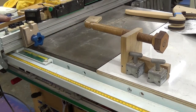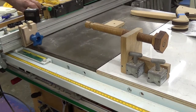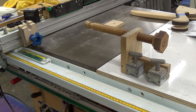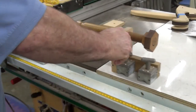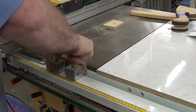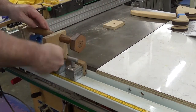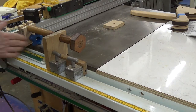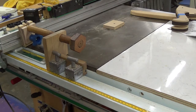Once you've done that it's now aligned. You can move the jig, move the fence to whatever setting you like. Once it's done, you roughly set your distance of your fence, grab the jig, put it on, and then it's just a simple matter of snugging up your fence. Snug it up a bit so at least you have the fence square, because there's nothing worse than moving the fence and then when you tighten it, it goes out of alignment as it straightens up.